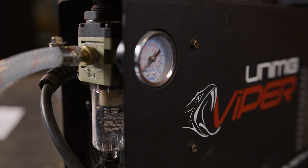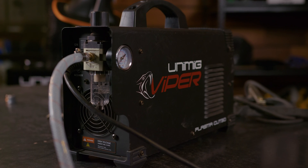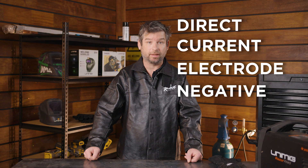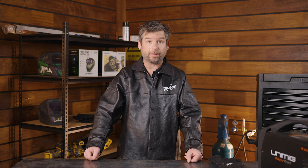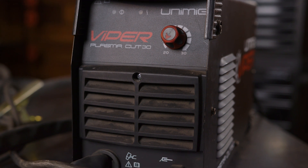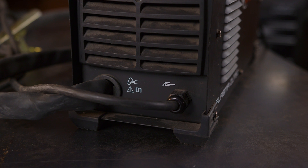So what's the problem? Airflow is one of the most important things when running a successful plasma cut, and these filters block the moisture as well as the airflow when they close. Plasma cutting is done in DCEN – Direct Current Electrode Negative. Getting the polarity correct on your plasma cutter is a lot easier than any form of welding, because the plasma torches have a different shaped plug. There's no guesswork involved – you literally can't connect your earth clamp or torch into the wrong connector.